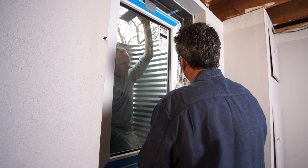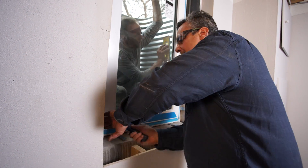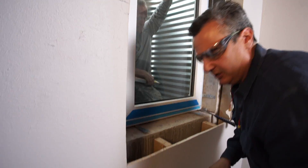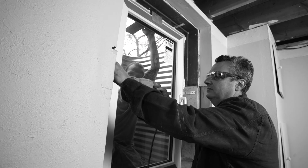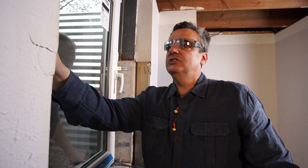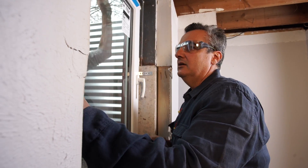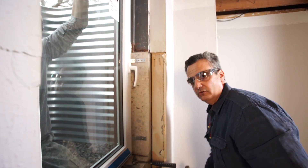We're perfect on both sides. Next, we tap these straps so they conform to the cement without putting any stress on the window. Then we take our hammer drill — already fitted with a 3/16-inch bit — drill the hole, put a lead fastener in from our pocket, and drive it home with a hammer. We double-check plumb again, and then switch to the other side to drill and fasten that strap as well.